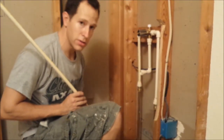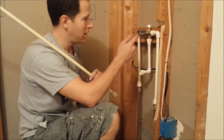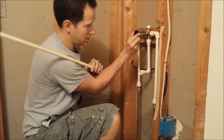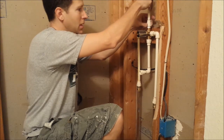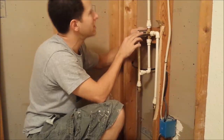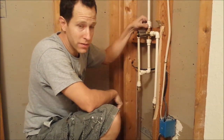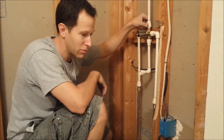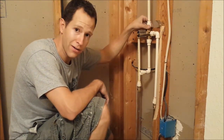We're basically done here — this is installed. I could turn the water on right now; it's in the off position. You can follow the instructions to put all the little trim parts together, but really this is the only piece you need for the valve. I did go ahead and install some blocking behind here so there's something solid for everything to attach to, and I put blocking up top as well. I made it about 78 inches from the floor of the tub to the water spout — that'll give anyone of average height the ability to get inside without having to duck under the shower head or buy an extension. It's almost all the way to the ceiling.